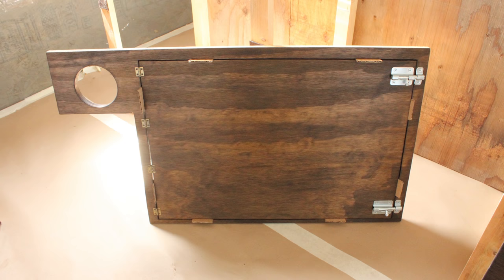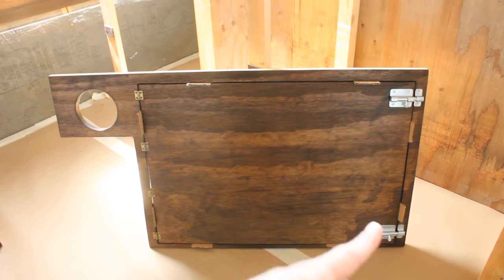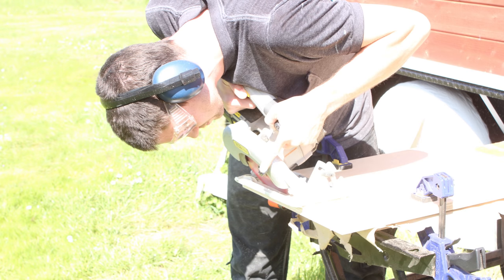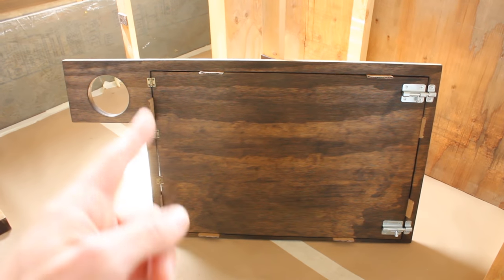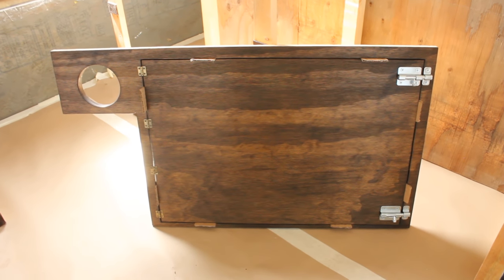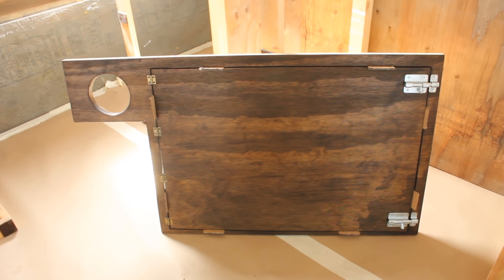And here's the front part with the door, so we can open up and access the bucket and whatnot. And basically use the exact same technique as our utility box door, where this is just one piece of plywood, and did straight cuts here. And then this one is a bit of an angled cut so that it kind of closes into it. And then just hinges and little deadbolt things. And we use small hardware because the trim is gonna be pretty tight on there. The perimeter is very thin just because of the way it needs to line up with the framing of the box, as will become evident when we go to install it. But this hole is for the ducting, for the basically the duct entering into the box.